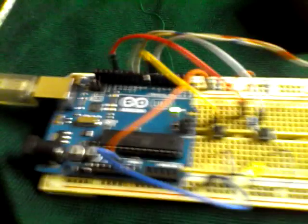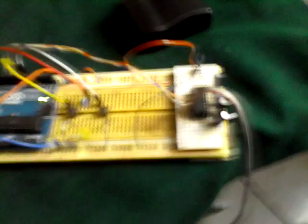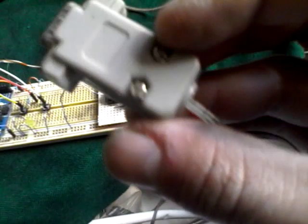I'm using an Arduino Uno board and a MAX3232 TTL level converter, just connected to transmit, receive, and ground. This is connected to pins 10 and 9 on the Arduino. These are the transmit and receive lines, and I'll show you the schematics of it.